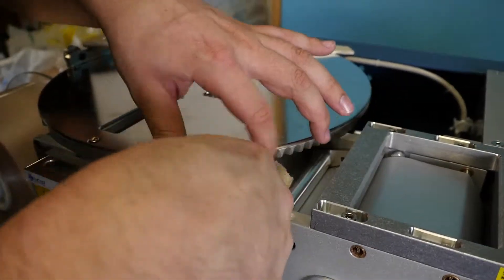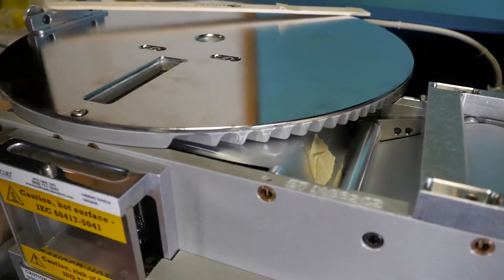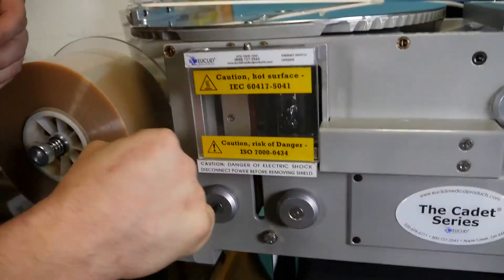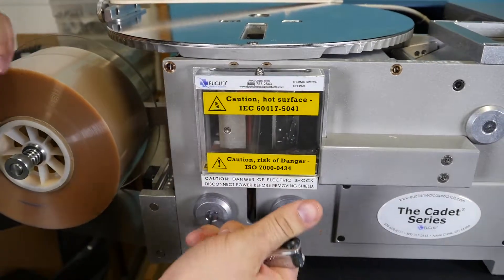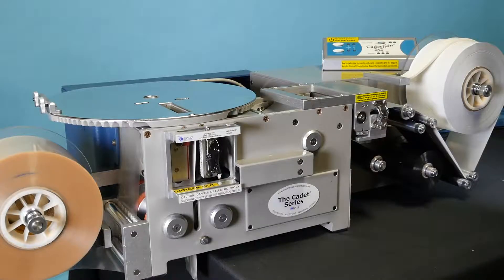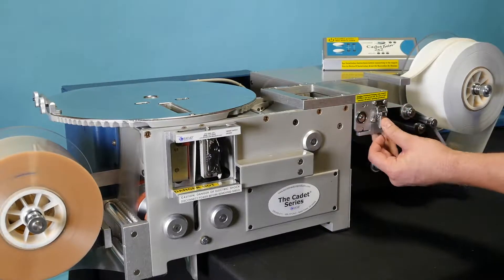Tape and adhere the clear or amber material to the foil. Manually rotate the end cap screw, pulling the material through the pull-down rollers until it feeds through the bottom of the unit. After re-threading is complete, make sure the printer assembly is fully locked back into place.